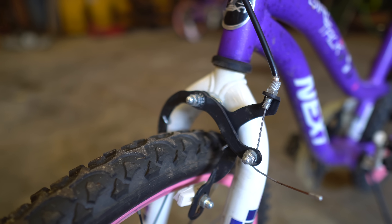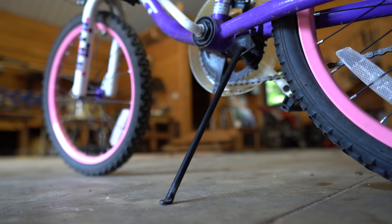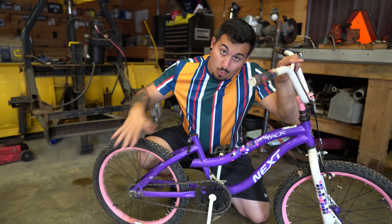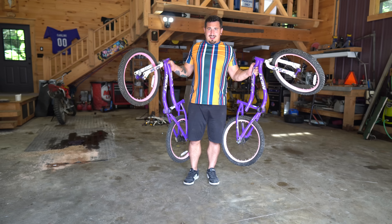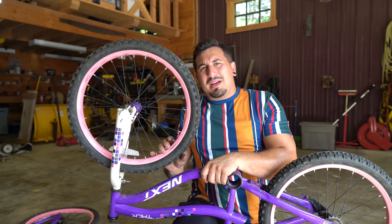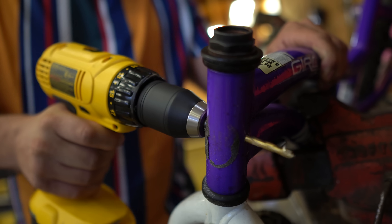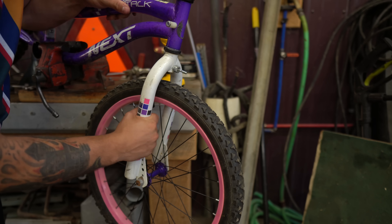To start, there was a lot of unnecessary stuff to strip off the bike — the brake assembly, the seats, the chain, the pedals, handlebars, the kickstand. Really the only things I needed were the frame and the wheels. I dismantled both bikes removing all the components until I only had the bare frames and wheels. Then I had to figure out a way to get the front wheel to stop turning, because that's just an accident waiting to happen. The idea was to drill a hole through the steering column and put a pin through it, but they still had some wiggle to them.